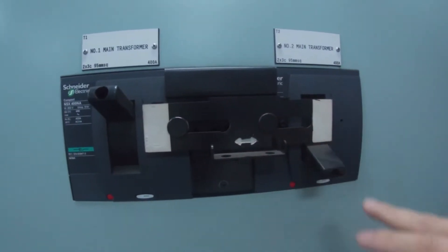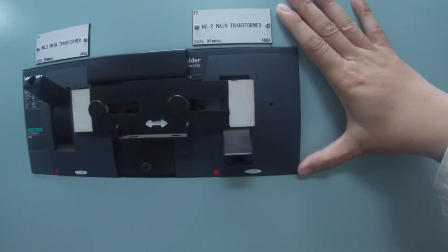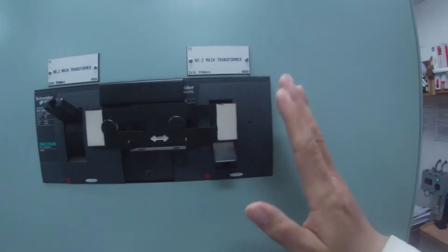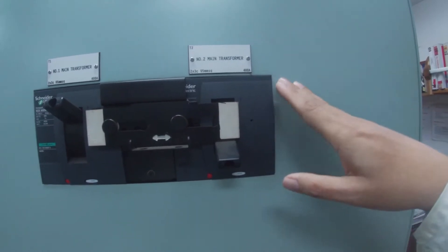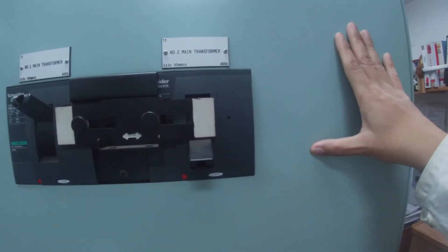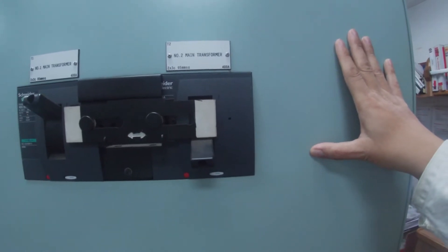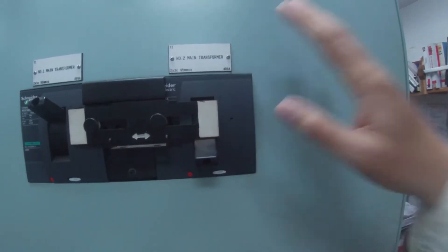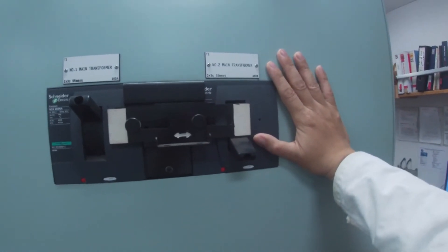The other one is locked. We will be using number two when we go to dry dock, because before the shore power kicks in we will transfer the service of the main transformer. Before that, we have to make sure the standby main transformer is ready — we have to check it, clean it, and inspect it so we know the situation of this main transformer.